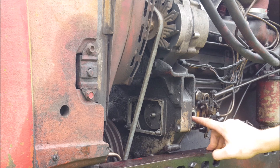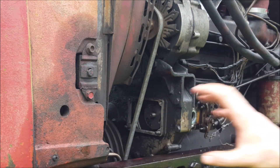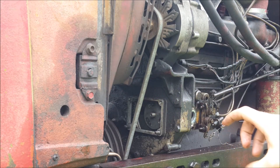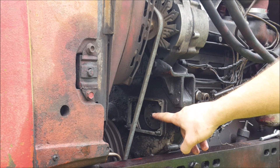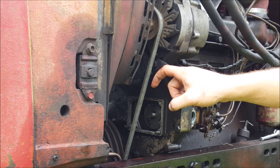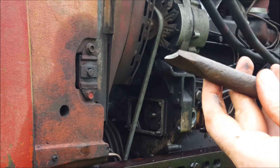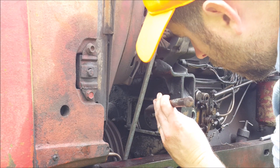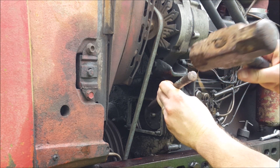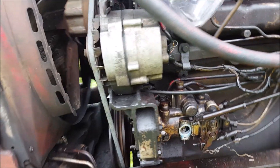I lined it up with this mark being where it needs to be, but the pulley is a little too far. So the pulley needs to come this way without my shaft moving. I turn the shaft hub that way a hair to match up with this. I have an old chisel that broke, but this little pointed side is actually perfect. I had to beat on it a little bit harder — I think we got it.